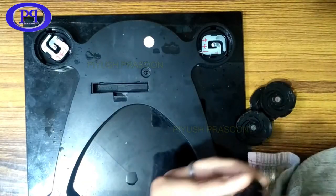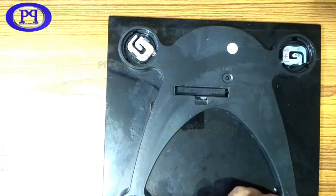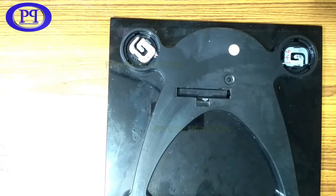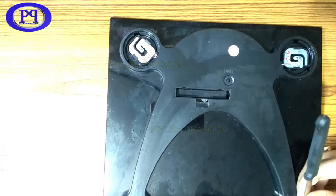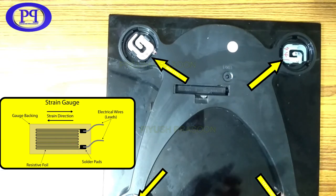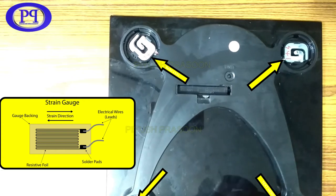The cleaning is done. You can see the G-shaped metallic objects fixed on the corners of the weighing machine — these are known as load cells and they are made up of aluminium metal. Each load cell is fixed with a strain gauge sensor, which is very small in size and is fixed with the load cell using acrylic glue. These sensors send values to the microcontroller, where the weight is decoded and displayed.